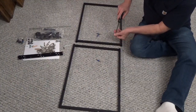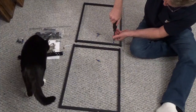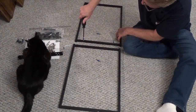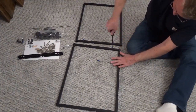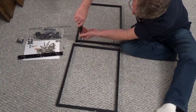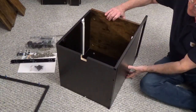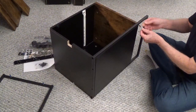Lay part 3 down and screw in two cam screws, part F, into each frame. Slide the cam screws into part 7 and frame the panel on each frame. Use four screws, part N, on each panel using the hex wrench. Don't tighten the screws down — you'll snug them down later.